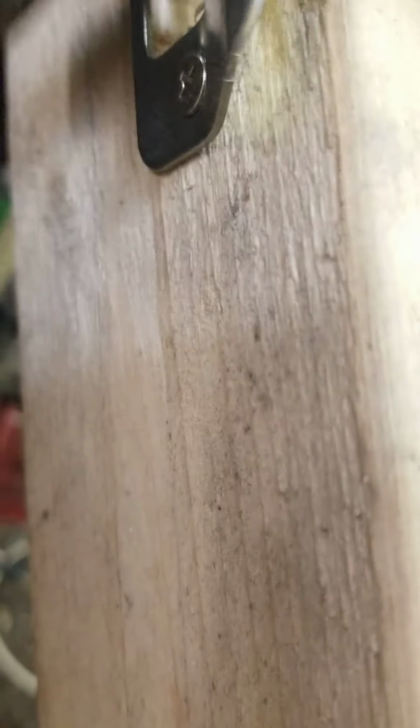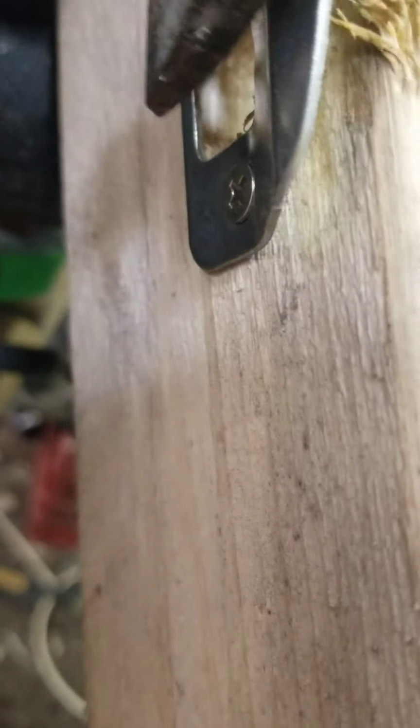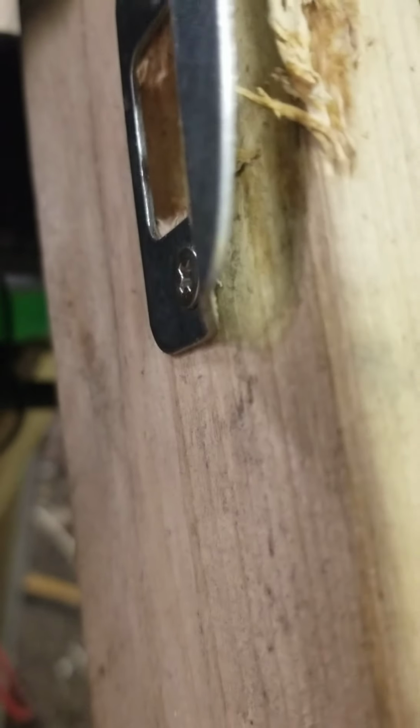And then also back here, the flex, right? If they can flex this or spread it, they can pull it away from the door and access that. Some doors come with this little bitty piece of trim right here, and you can easily pop that out. If that's not wood glued or something to the door frame, they can easily pop that off and then have access to the back side of your lock. So a shim would come in a lot easier if you did not have reinforcement there.